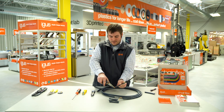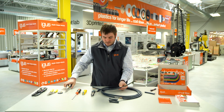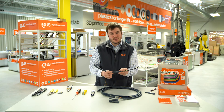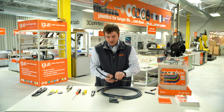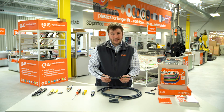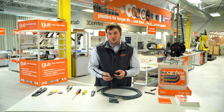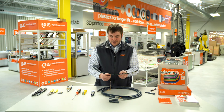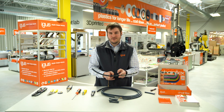You pull on the rip cord and, as you can see, we've stripped the jacket back from here all the way to where the rip cord ended. You can then peel back the jacketing material to see the conductors. Having not used any kind of blade, we know from this point all the way to the end the conductors are 100% safe and untouched.